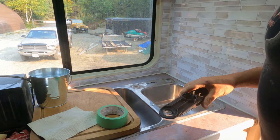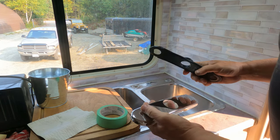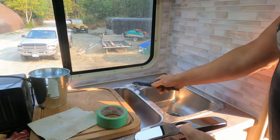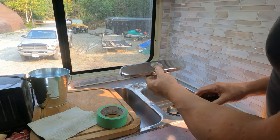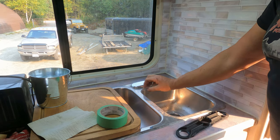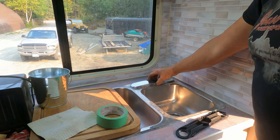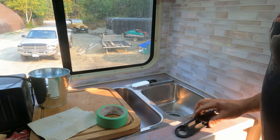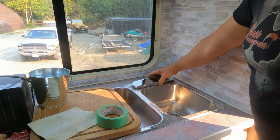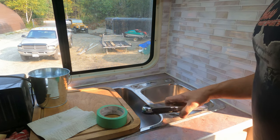The new tap has an option for single mounting or triple mounting, which comes with this plate. We're going to triple mount because the old one had the outside holes, so I still have to make the center hole, but this plate covers it hopefully. This one's rounded, the other one was square. I'll clean everything up and hopefully you won't see the marks of the old one. I'm going to need a big hole saw to make the hole — it mounts under there and through the stainless steel sink; I just have to get through the countertop.